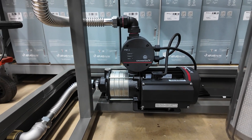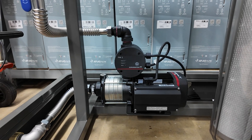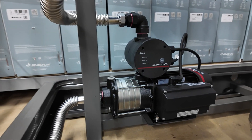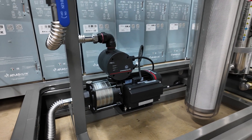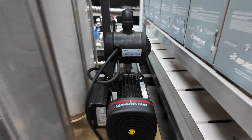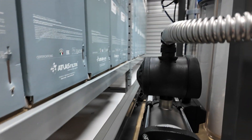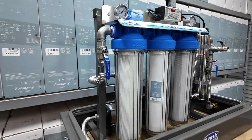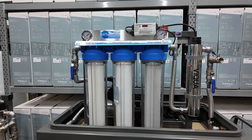The pressure pumps we use come in three different models. This one here is your multi-stage Grundfos pressure pump, the CMB 546 — this is what we'd use on a large family home or a two-storey application. The next model down is the smaller one, the 337, which is a really good pump for your standard domestic home. And up the top is the Grundfos CMB SP 5-47 — that's a self-priming pump we use when pumping from in-ground rainwater tanks up into a home. It has similar performance to the large pump but is designed for that suction lift application.